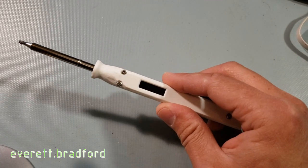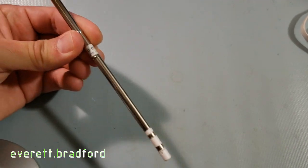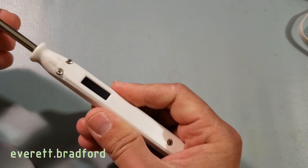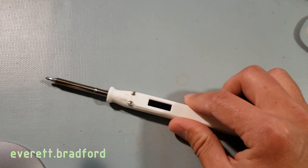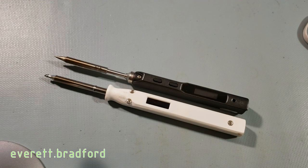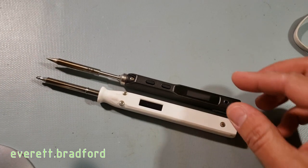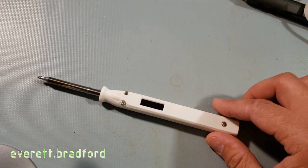This is my scratch-built portable soldering iron. It uses interchangeable HAKKO T12 tips and is powered by a quick charge capable power bank by USB Type-C or USB micro cables. It is a very similar size and form factor to the TS-100 iron, and it fills much the same role, but it adds the capability to use the ubiquitous T12 tips and to be powered directly from a USB power bank.